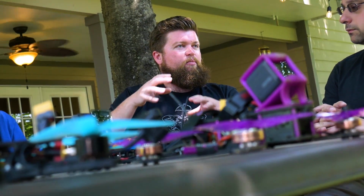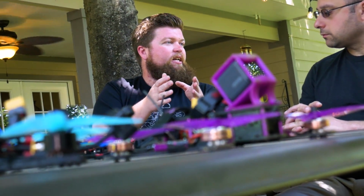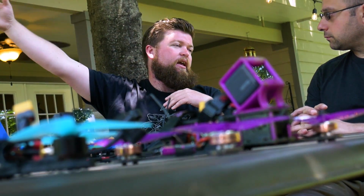It very much highlights that motors lose efficiency at high throttles, which I think a lot of us realize: as soon as you hit 90% throttle and above, the acceleration drops off and your power consumption goes up. With our prop designs, we recognize this even more because our target is always around 60% throttle. Above that, it gets very heavy in the amp draw. But we've also noticed that the speeds go up a lot.